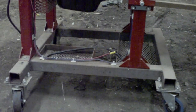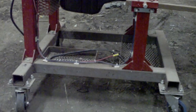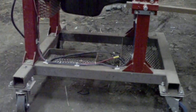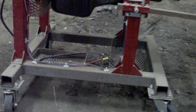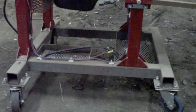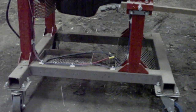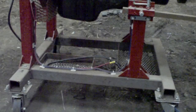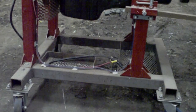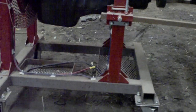Looking at the base here, it's 2 inch square tubing with a 1/8 inch wall. The caster support plates are 1/4 inch plate, although it looks like it might be 3/16ths plate — once again, not too critical; just do a good job welding them. The casters themselves are 4 inch casters, which is what I had on hand and works well in my shop since anything smaller digs into the dirt floor. The battery tray is made from 1.5 inch angle by 1/8 inch with expanded metal for the bottom. In the front there's another tray made entirely of expanded metal, and that's for a small fuel tank.